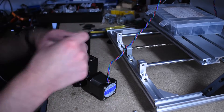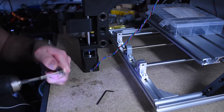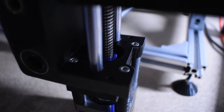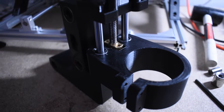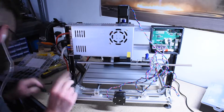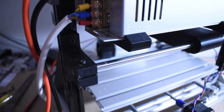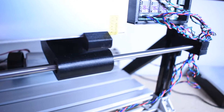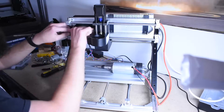The rods are nice and snug. The next job was to get the z-axis stepper back into place. I had to redesign this part too — the original looked really flimsy and brittle, so I thickened it up and added a recess for the cap head bolts, ensuring we're not sacrificing any z-travel to bolt the motor on. After reassembling the z-axis I attached it back onto the x-axis rails and checked that it moves smoothly on all three rails with no friction or weird forces. I left plenty of clearance at the back so we're not interfering with the power supply or any cables — you do have to tidy up cables with cable ties, but that's pretty standard.